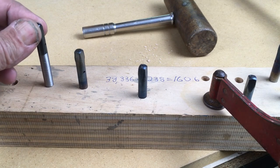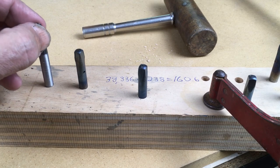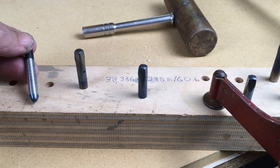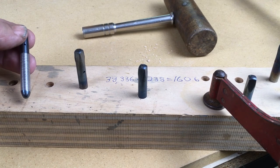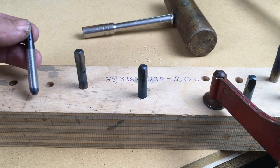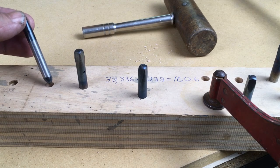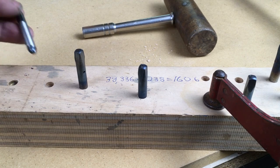And if you try and put the pin back in, it has nowhere near the torque it had before, and it may not have sufficient torque to hold the tension. And the only option then is to put in a larger pin. They usually go up by about 6 thousandths. So you can never really get the same pin back in.